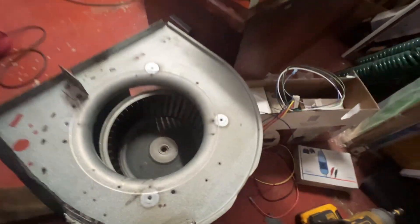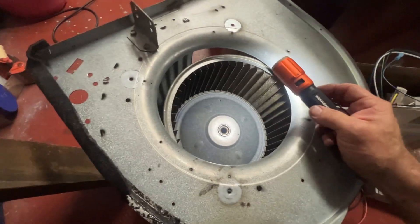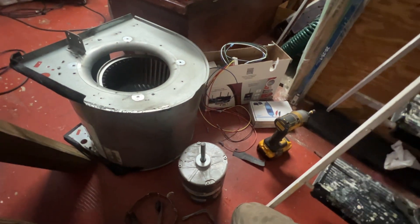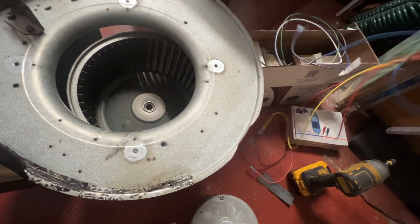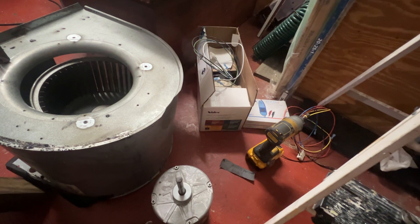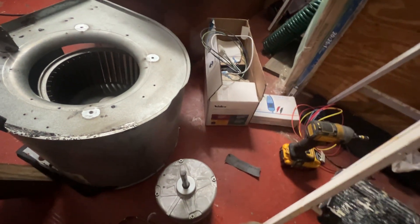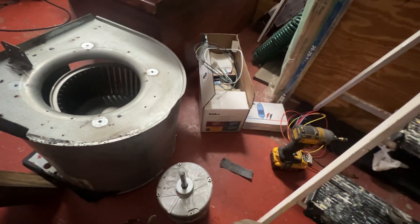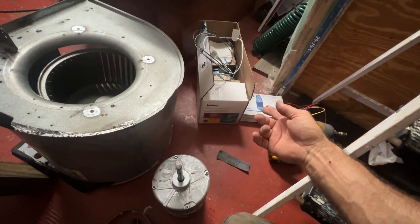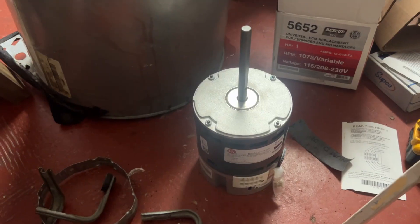All right, so I got that pretty much cleaned up — the best it's going to get right now. It's not new but it doesn't have all that kind of cheese between the vanes anymore. You're probably asking yourself, why don't you just put a PSC in there? Well, when I went to look at it, it's one horse. First of all, there weren't any in stock around here. I knew they had the rescue motors and the X13 one horse. And this ended up being less money than a PSC if they had the PSC in stock. I think these operate quieter too than putting the PSC. By the time you put in the relay and all that stuff, just do the work with this. And they're going to get a two-year warranty with this motor. So when you're comparing to the PSC, I think it's just a better deal.